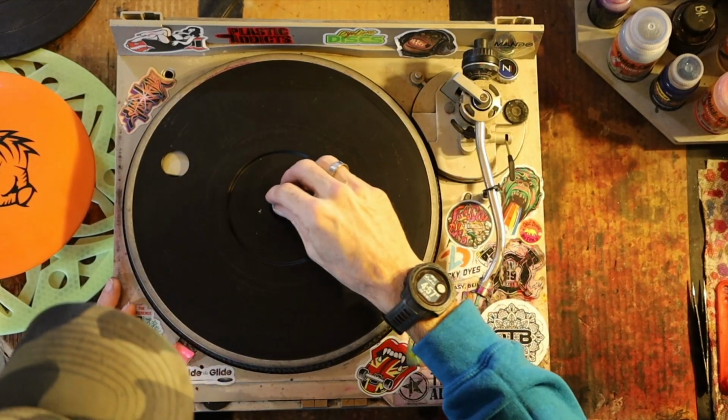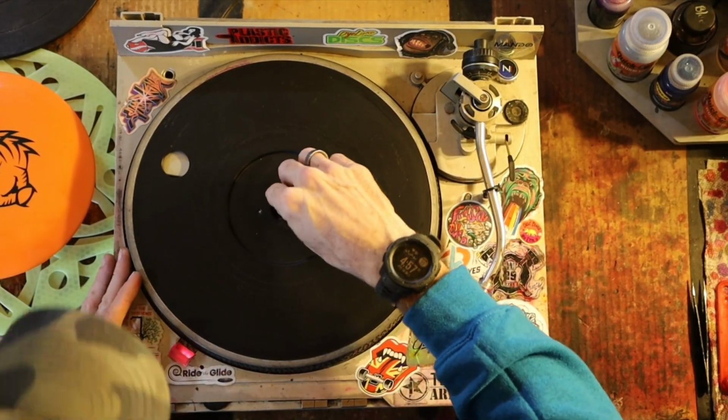It fits right onto the spindle, obviously, over top like that, and then it's got a little nub that sticks up, perfect to fit right into the hole of the Clara Chuck. Here's the problem, though. This little cap has just a little wiggle. It's not perfectly tight on the spindle, and that wiggle was just enough to kick the thing off center while it spun.